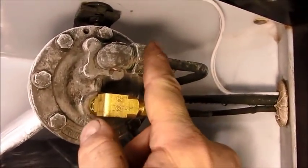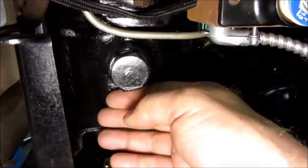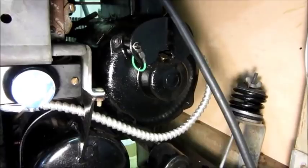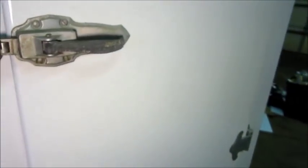In order for this to work I had to close off one of the valves — the king valve back there that restricts the high pressure liquid line. In order to get it to work right I had to restrict that, and if I leave it wide open I get a back-flooding problem where the refrigerant liquid comes back to the compressor, the compressor base starts to get cooled, and the low side goes up around 30. That tells me the float is not closing off when the evaporator gets full of refrigerant. Remember my test in the sink — I tried to get it real close to the oil return. Apparently I got it too close. My next step is going to be to adjust that float downward and run it up again and see what happens. I've reached a stopping point for today, but it is functioning and refrigerating. I don't know how long it's been since this has functioned, but it's doing it now.